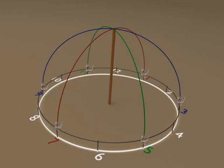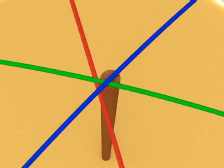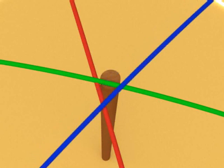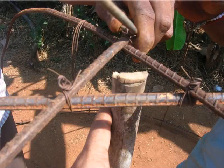The 12 feet steel rod arches should be at an angular separation of 60 degrees at the base. Now we have three arches for the frame of the dome. Next, carefully slide the steel rods at the top such that a small gap is left open in between. Tie the steel rods using steel wires as shown. The intersection of the three arches will look like a triangle.